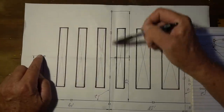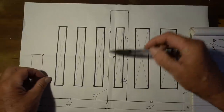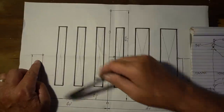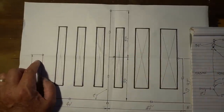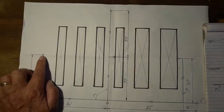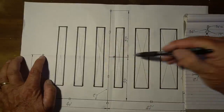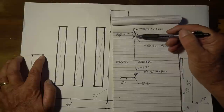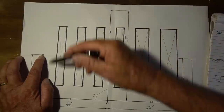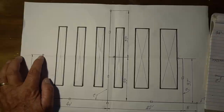I'd say maybe this valve and this valve, and I can shut these valves and I could cover this 100% with just two valves. So I'm not watering the entire complex just to do two or three beds. So I can use any combination of these sprinkler heads simply by shutting this ball valve right here, because every one of these risers to the sprinkler heads has a ball valve in there. So we can isolate. We can run the entire thing at one time, all five heads, or we can run one or any combination thereof.